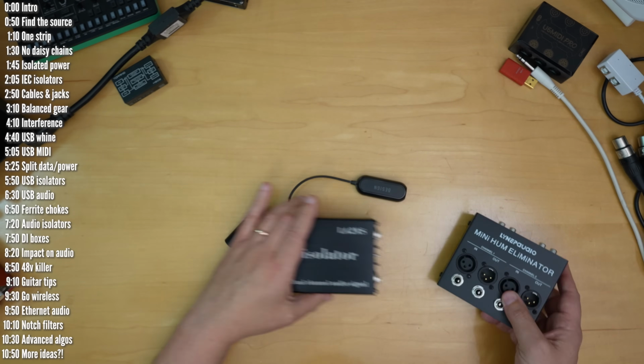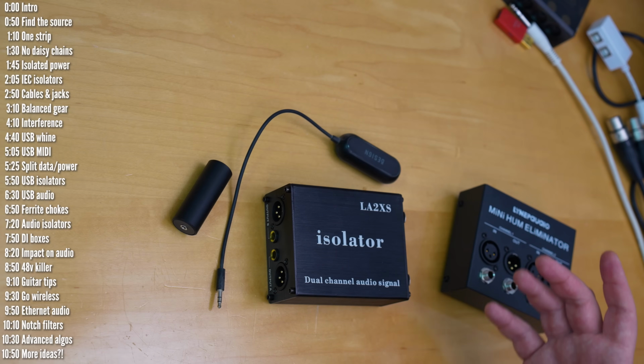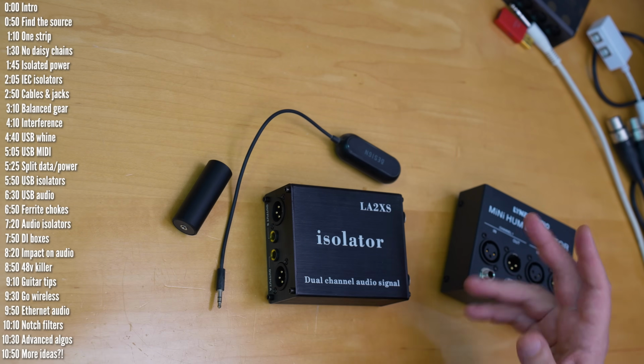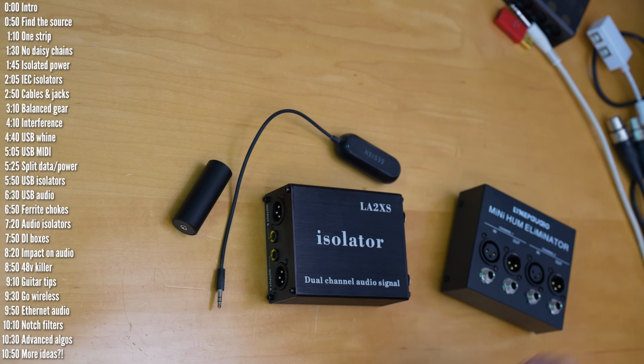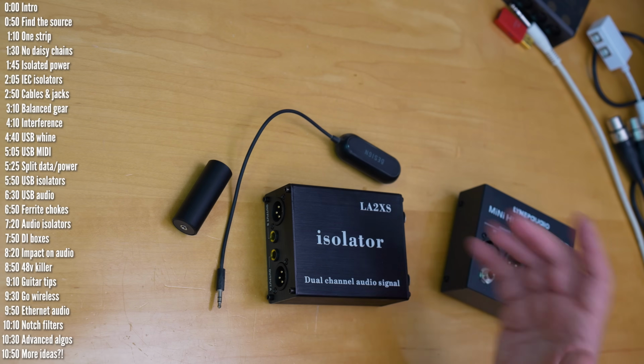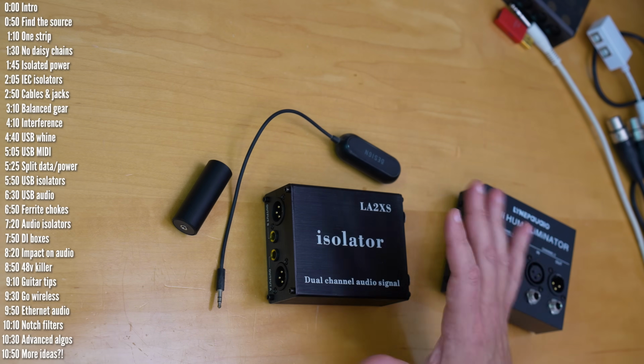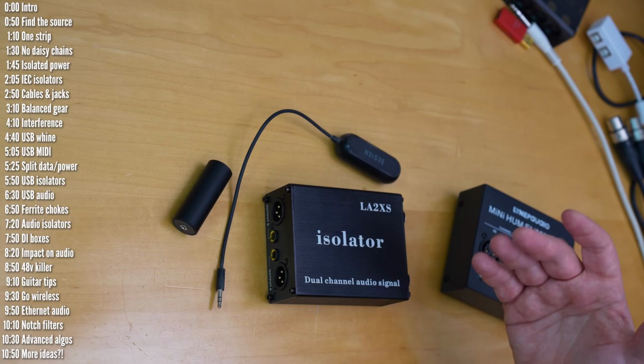They may impact audio quality with harmonic distortion and potential reduction in the lows and highs. Polarity of the signal may be inverted too, but that probably matters less. These work using transformers, and one might say that analog transformer harmonic distortion is desirable, but you should know what's going on. My experience is that it depends on levels.